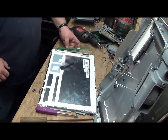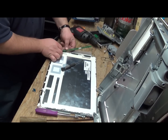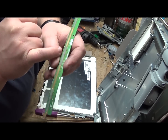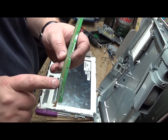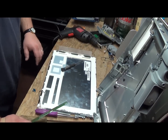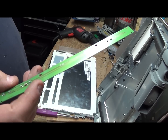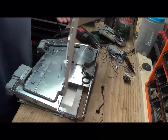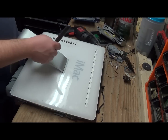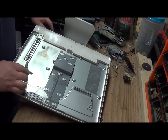When I pull these off, I try and get them flat with these little ribbon wires and pull up and away — that's so I try and keep the gold foils on there, and pull part of the wire off with it, because that'll come off in the AP. It's easier than having to clip off all of these things. Here's another little gold plated board, just like a RAM finger chip. You want to pull out those monolithic ceramic capacitors. This back piece — you're going to want to make sure you check the stand, because this is going to be aluminum. You're going to want to get that off because that's a good bit of weight right there.